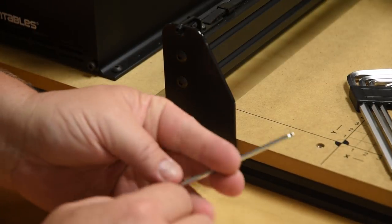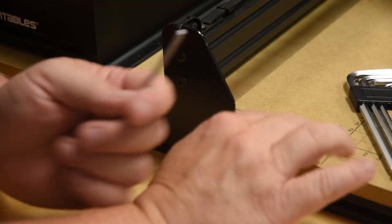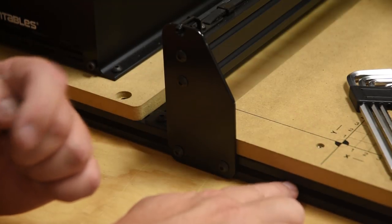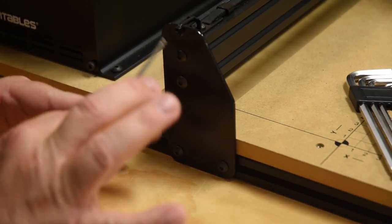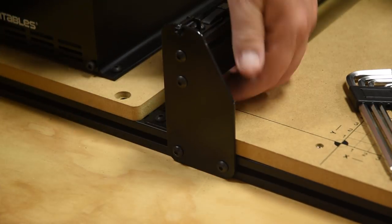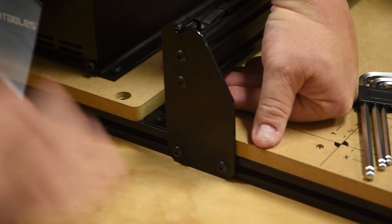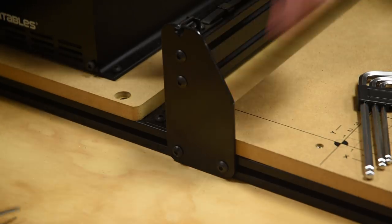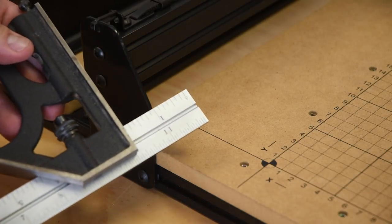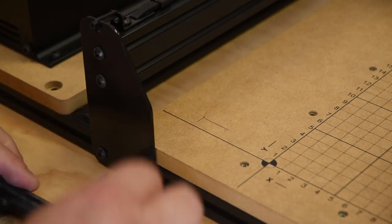The final part of this is going to utilize the flat surface here. The wasteboard is anchored down to it and keeps the frame itself down on it, and then flattens this to that frame. We can then use these two bottom screws on each corner to do some minor adjustments. I've loosened these to show you that there is about an eighth of an inch of play in there. So there's got to be a systematic way we can take advantage of that to increase the flatness of our entire machine. My tabletop is as flat as I can make it, so my first step is to focus on the MDF substrate — the wasteboard — and get it anchored down so they form a nice, flat, parallel surface.